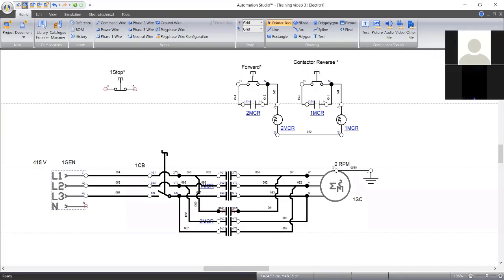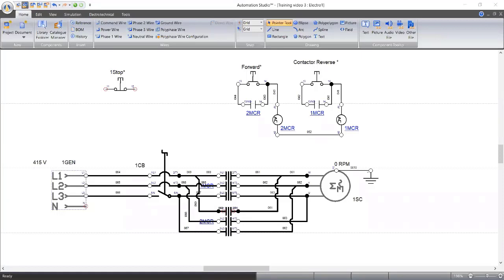Engineer Shola, what I said then was, if you want someone that will stop the other one before starting one, you won't be using just two contactors. Probably you will add another extra relay that will do the job of the stopping and starting. You understand? I think you said you had another idea. So let's hear from you again, while I tidy up this circuit.